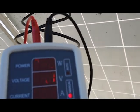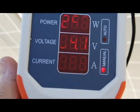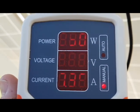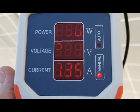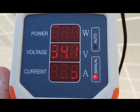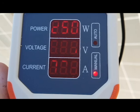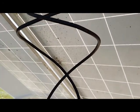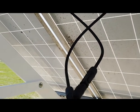One of the reasons I got this Ely Joy is because I wanted to see what panels produce. It's about noon, but it's not solar noon. Reading 250 watts, 34.1 volts, 7.35 amps. It plugs in right here and clips into your MC4 connectors right there. It comes with two different sets.